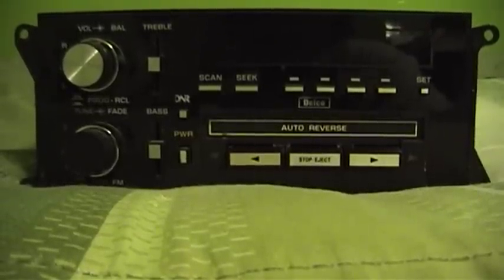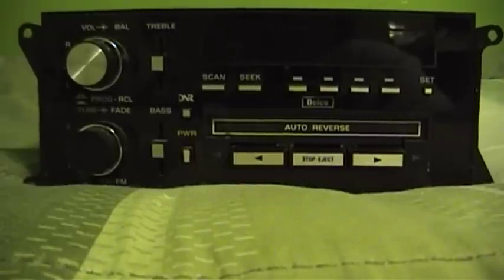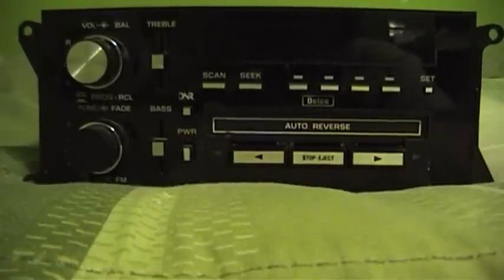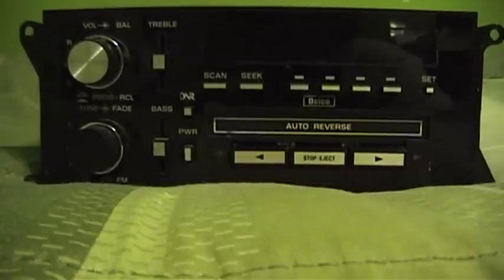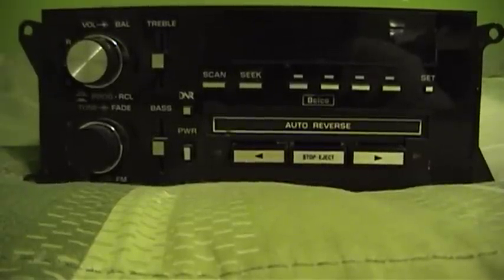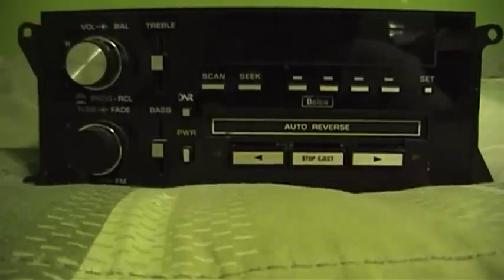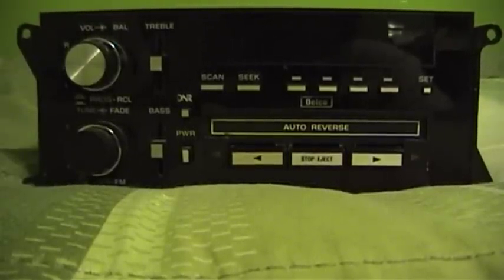Well, there are a couple of systems that do that, but the one that I'm going to talk about tonight is probably the most popular of any of them, and it is known as dynamic noise reduction. Now, dynamic noise reduction is a system from National Semiconductor that requires no pre-encoding or pre-processing of the source material that is presented to it. No matter the source material, the DNR system tries to remove the noise using a couple of different methods, of which I will discuss more later.